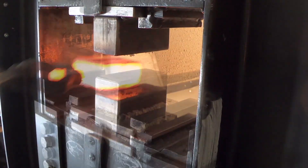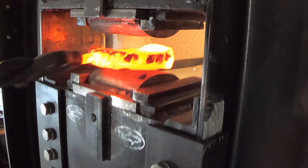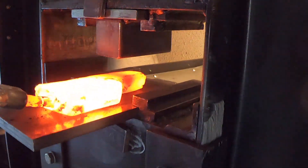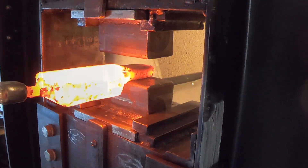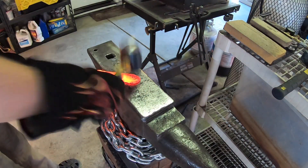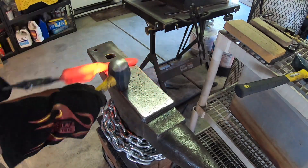This is the final restack and this is where things get a little interesting. I wanted the heel of the knife to be right under the bolster so it had really good balance. The first thing I needed to do is isolate some of the steel for the bolster and for the tang, which can be tricky because the steel doesn't always move the way you want. I managed to use this one-inch piece of plate to my advantage. Now I'm drawing out the tang — it ended up being a little long, so I wish I'd drawn it out the other way to get some width. When you do an integrated bolster, that really becomes part of your handle, so you need to include it in the length.